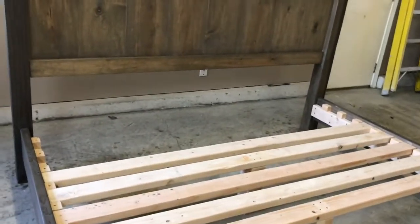I don't know if I would do it that way again. I really like the idea of being able to take the bed apart easily, but honestly, it's not real easy with these because, you know, I didn't mortise perfectly. The depth isn't perfect. The board isn't completely straight, which makes it hard to line up to both sides. I had to call in my husband to help me with this part, and he got it to work, right? But I don't know if I could do it myself. Anyway, I think I might try to do something different if I were to build this bed again.